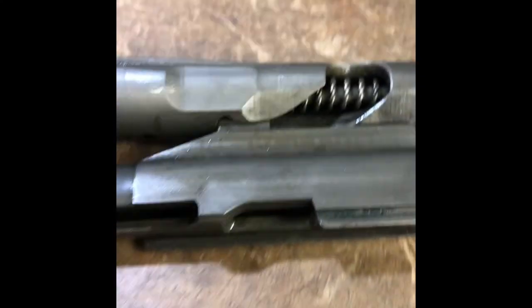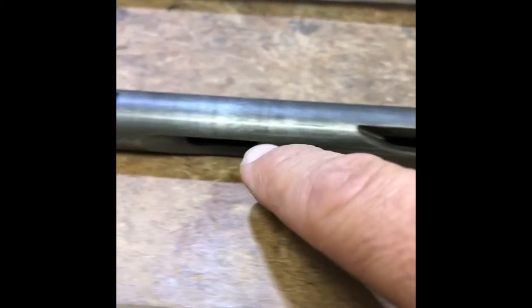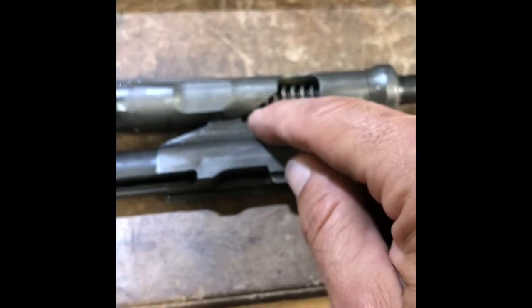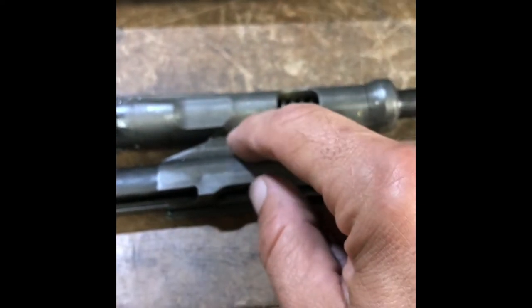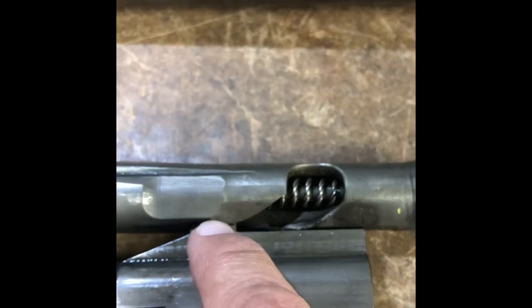The bolt and carrier — this is your semi-auto sear area, this is for your disconnector, and this is your full-auto sear area. Not too complicated. Of course it's all milled. The firing pin just travels up and through the bolt. The firing pin is actually controlled by a little shoulder — it's locked into this little shoulder by the carrier. Like the M60, when your bolt is locked it allows the firing pin to come out; when it's unlocked, the firing pin can't come out because it's locked to the rear by your carrier.